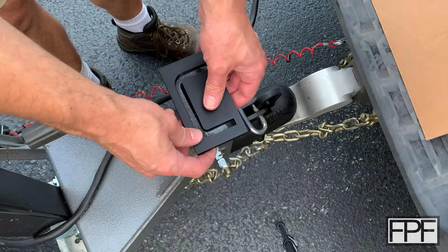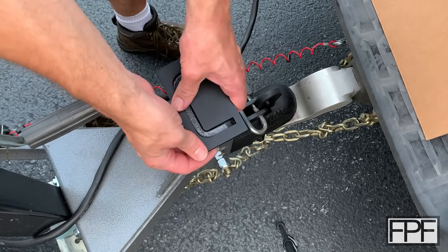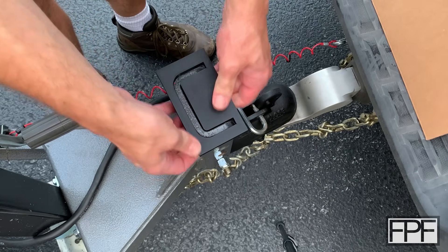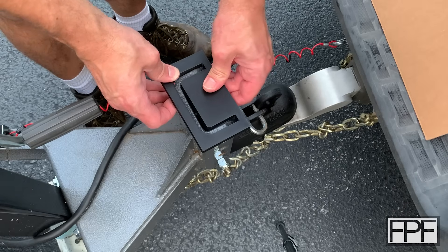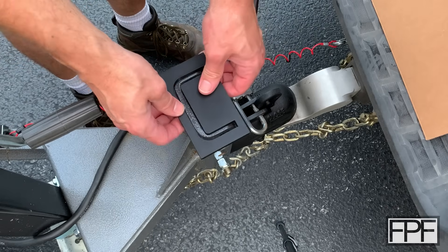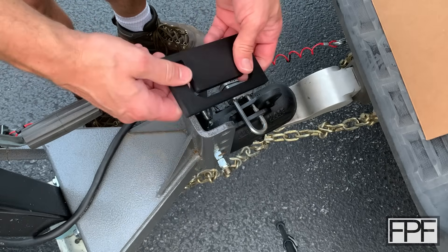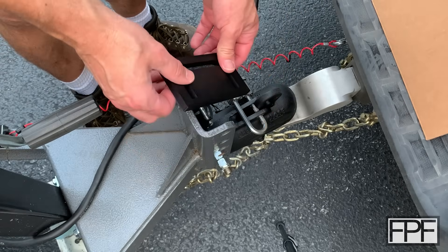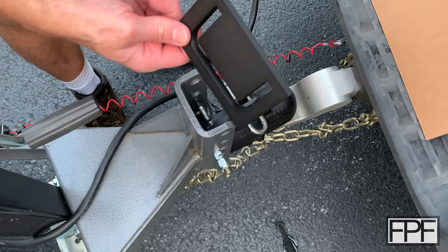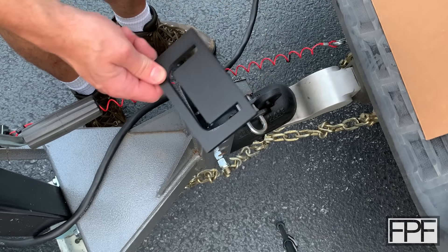Let's see how we did — it's close. Maybe not. This is too wide here — it kind of starts to go on on one side, but the other side is off at quite an angle. This one seems to be bent out more on one side than the other, and I didn't realize there's actually a slight curvature here too. This one clearly does not fit, though we're close on the thickness. I'm going to keep iterating. I'll take a picture top-down on this and adjust from that in CAD and just keep iterating until it fits.